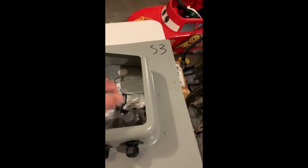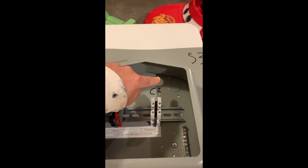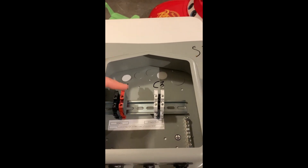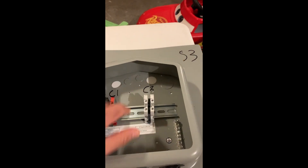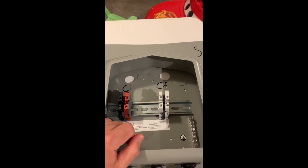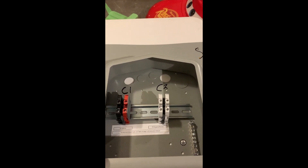Inside, there are knockouts that you can use. In my case, I'm going to have two wire runs — two separate circuits. So I have two knockouts that I used, three-quarters inch, but you can use up to one-inch knockouts and there's half-inch as well.